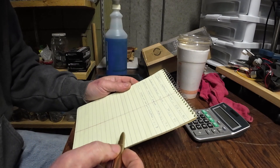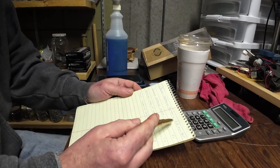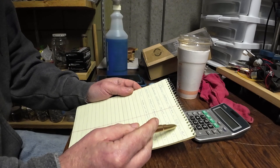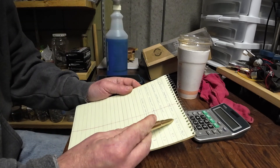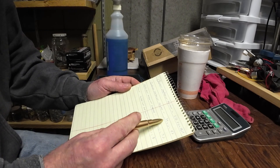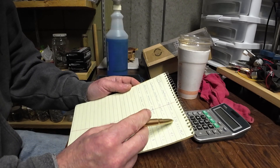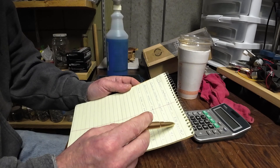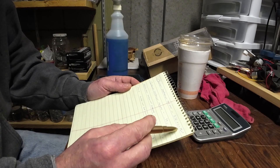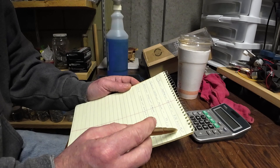To find out how much actual power each unit is using, take your amperage reading and multiply it by your system voltage — in this case 12 volts — and that gives you your watts. I've done that for each one. The big Chicago Electric unit had a lot of draw: 38.64 watts of energy consumed at idle.